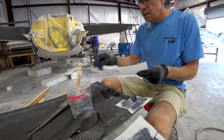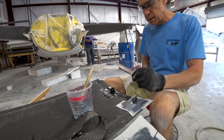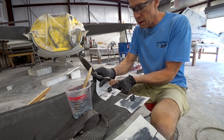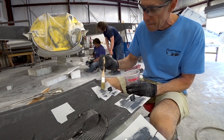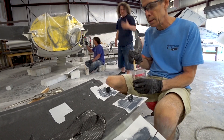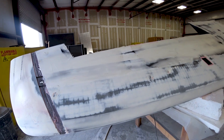Everything's getting really close to the time where we can actually start spraying some primer. Another little job here on the baggage doors — I got my hinges all sorted out, and just five minutes in I finally had time to bond them into place. I'm doing a quick layup of a couple of plies around the hinges and then peel-plying it out. Baggage doors now just need the key locks put in and they're all done and fitted. Next week, hopefully I'll have time to sort out the retraction mechanism for the nose and main gear doors.